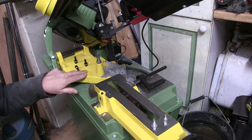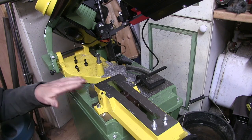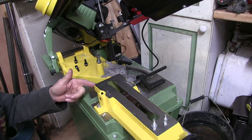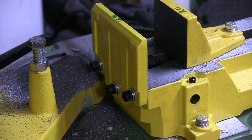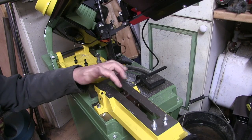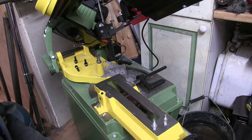But with this one, because you've got this extra bit which swivels so that you can do an angle cut — the whole bandsaw swivels rather than the vice — you've got this extra height. You've actually got a proper vice on this one, and this back jaw is just held on with three bolts on the back. The moving jaw is just held on with two bolts onto this, which obviously moves the handle.